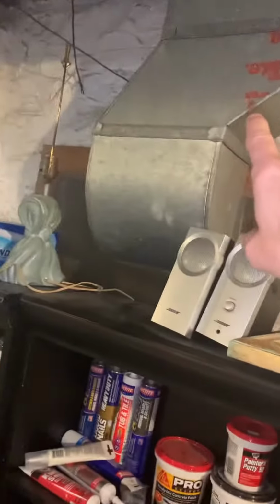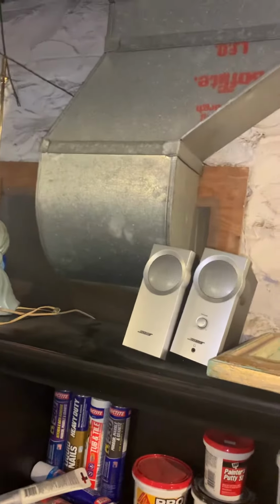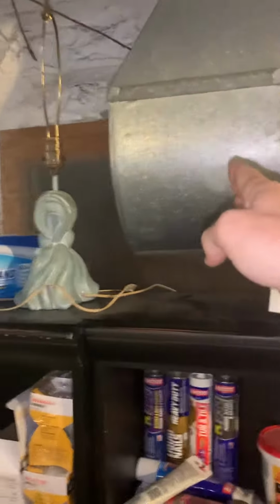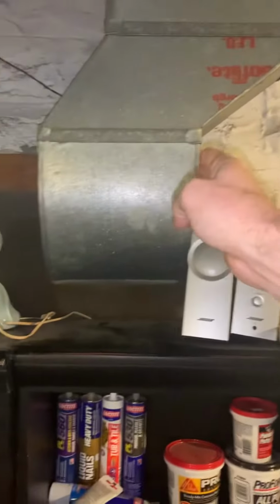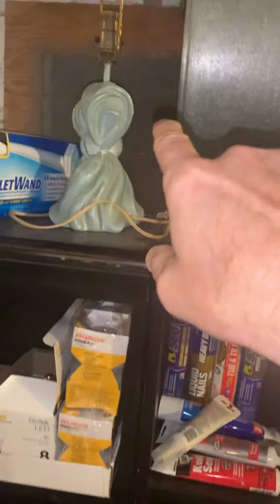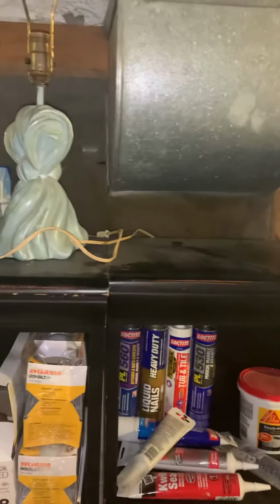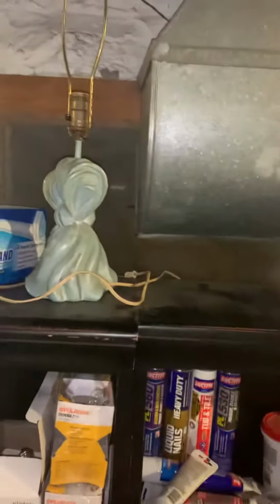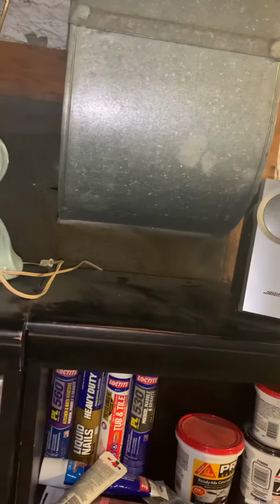This is 8x16 coming down, and then we cut down to like 8x12. We want to keep this at 8x16, so we may cut this throat just a little bit shorter, get our offset down into here. We got about a nine inch offset, and then this will remain 8x16. This trunk line stopped just inside there. We want to run 16 feet of insulated 8x16, and then tap our 2 8-inch runs back off of that and then add one.